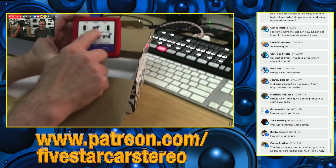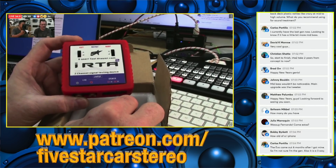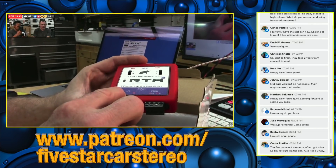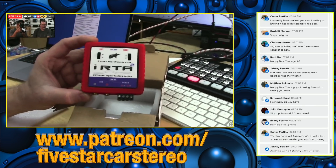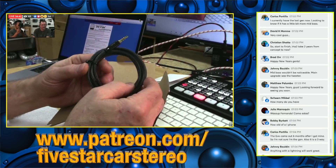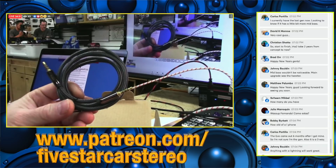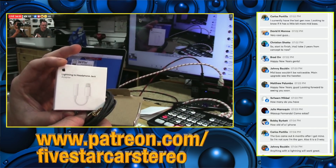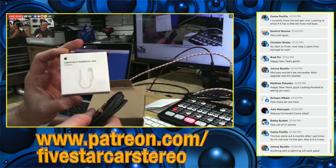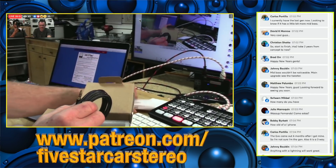It's two-channel — left and right switches so you can turn them on and off independently. When you turn them both on it sums the signal together, and you'll see your all-pass filters. If you have something wired backwards, the RCA inputs work the same way. It is low-level and high-level — it'll take up to 20 volts of input, so it'll work in most environments. In the bottom there's a four-pin, four-conductor adapter — not a standard three-pin aux — designed to plug into your Apple aux headphone jack adapter, which then plugs into the bottom of your phone.